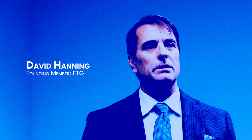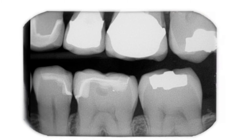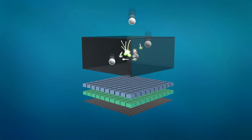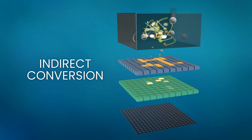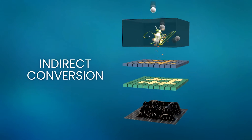The problem with traditional sensors is, one, there is glass inside of the encapsulation and the glass optic plate breaks easily. Secondarily, it was the image quality. It's based on what we call indirect conversion, and you get an inherently fuzzy image because we go from x-rays to light, from light to digital imaging — that's indirect conversion of x-rays to digital imaging.